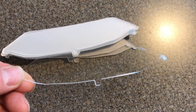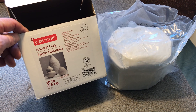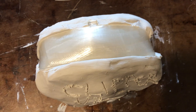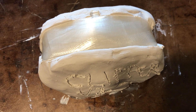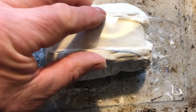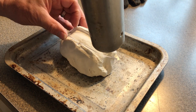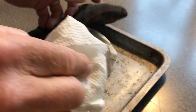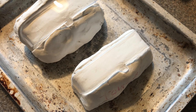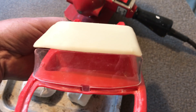You have to pull off the protective film on both sides. I wanted to make a mold to heat the plastic against, so I got some air-dry clay, took a large mound of it, got it close to the shape of the part, then pushed the 3D printed part into it and cleaned it up a little bit. Now here's the clay dried — you take the clear piece of flat stock, put it on top, and then heat it up with the heat gun to shape it. I've got my nice heavy-duty heat gun. The heat gun gets the basic shape over the mold, but then I found the best thing to do while it's still warm is to put the part in, make sure it fits, and also make sure the roof line fits okay.